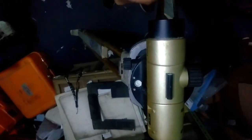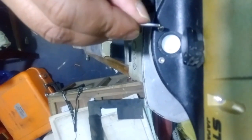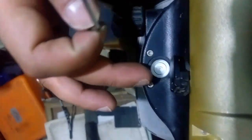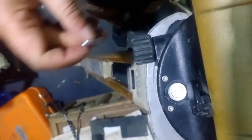I'll rotate this device to 180 degrees and check the bubble. You can see my bubble is now coming towards the center — the error is minimized. To bring the bubble towards center from this side, I need to move the align key in the clockwise direction. With a little movement the bubble shifted a little bit towards center. I'll rotate it to the other direction and show the progress.